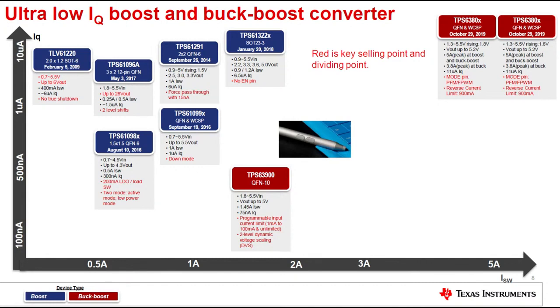This chip is right there in the sweet spot. It's got an internal switch of about 1.5 amps — note that doesn't mean the output is 1.5 amps. It means the internal switch that does the boosting or bucking is about 1.5A. The actual current you're going to get is, for boosting, about half an amp — about 400 milliamps — and in buck mode about 600 milliamps. So it's over 300 milliamps or so depending on the voltage input and output. But what's really nice is the ultra-low quiescent current: under a microamp.